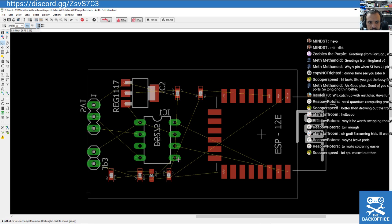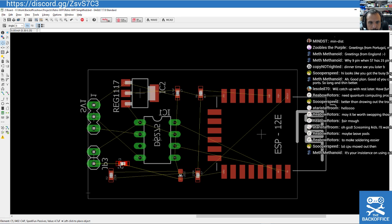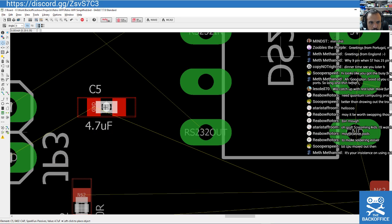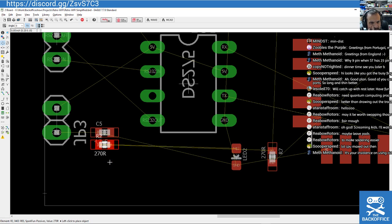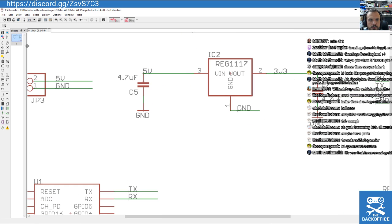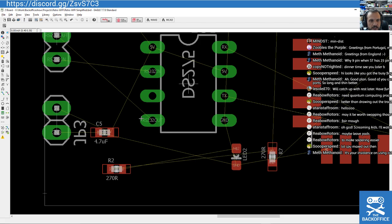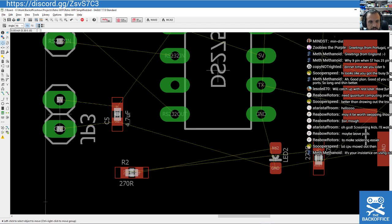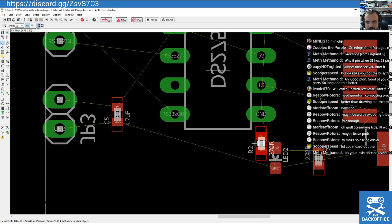If it can't route around this slot, then I'll be a monkey's uncle. Can't quite see which way around that bloody thing is. Looks like a capacitor, but there's only the ground connected. Hang on, C5. Go, Gadget, go. Huh. There we go. That's C7. That's connected. Yeah, C5 wasn't quite connected anyway. Now it is. Nicely spotted. Kind of makes you wonder how many of your designs have little flaws like that you never notice.